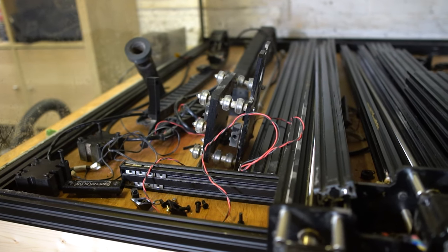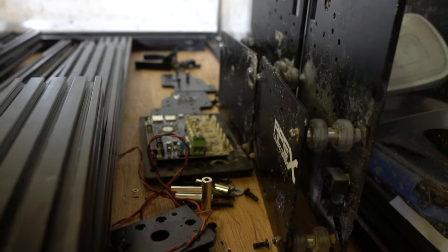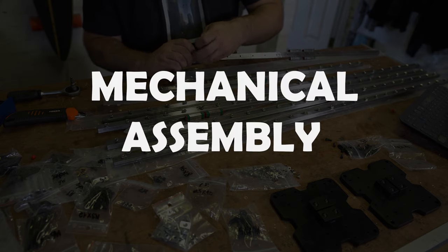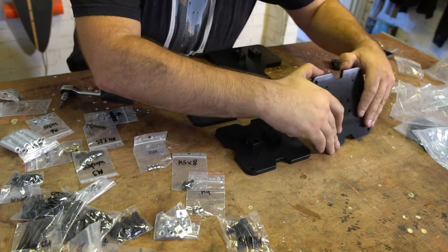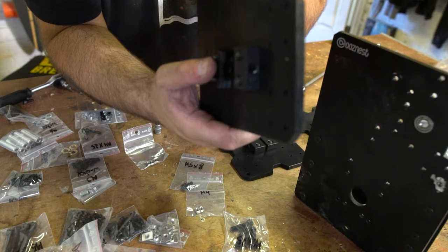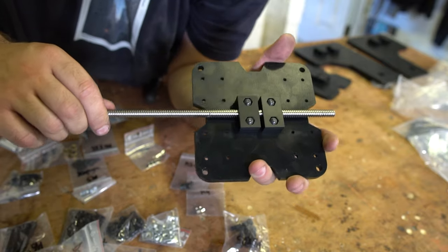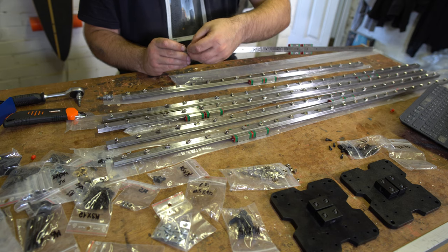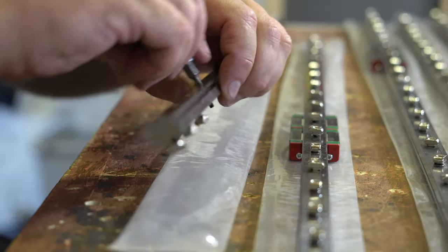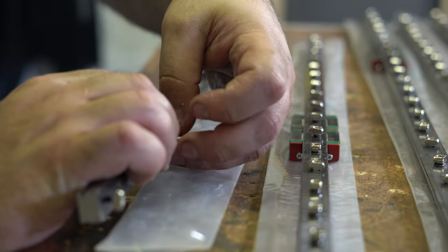I decided to store everything back in the enclosure and rebuild the machine on my workbench. Following the instructions, the first thing I did was attach the nut blocks to all the various plates — and here you see another upgrade over the old WorkBee: the WorkBee has nut blocks standing on spacers, whereas the Killer B has them bolted directly to the plates, increasing rigidity. After adjusting the nut block tension, it was on to preparing the linear rails. This is the most tedious part of the assembly — getting all the bolts and T-nuts into the linear rails ready to bolt them to the beams. It takes ages, but I put some music on and after about an hour I had it all done.